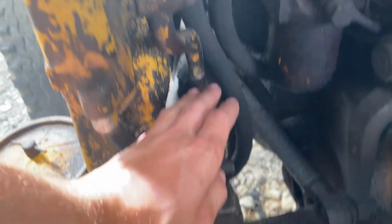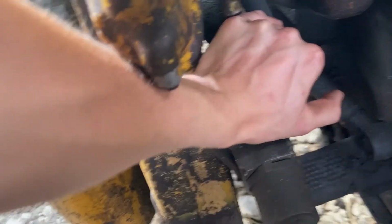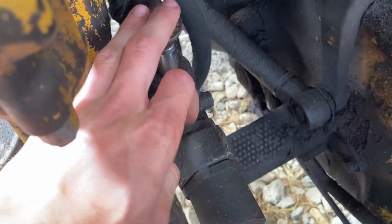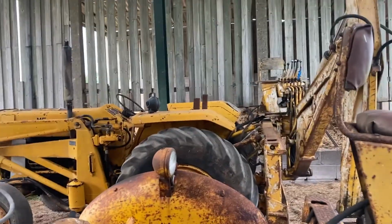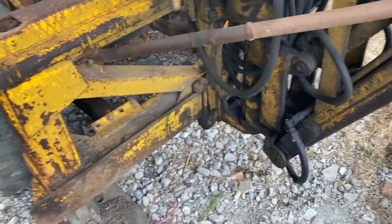And the difference, you also have to, when you change between digger and back actor, that little lever, I'm not 100% sure which way is which yet. It separates oil flow from the back actor, and you divert it from loader to back actor, which seems a bit overly complicated. It seems that one doesn't need it. I suppose it puts less stress on everything and you get higher speeds.